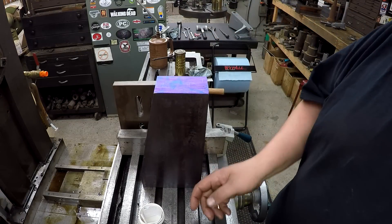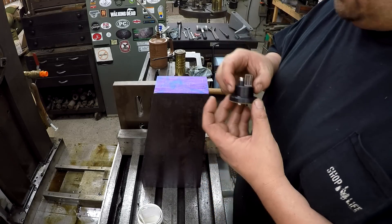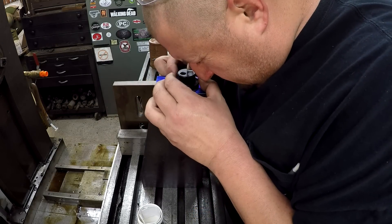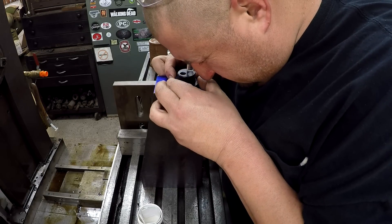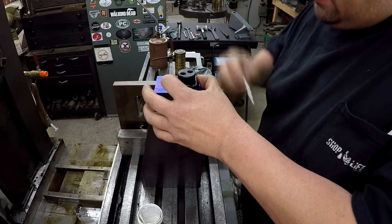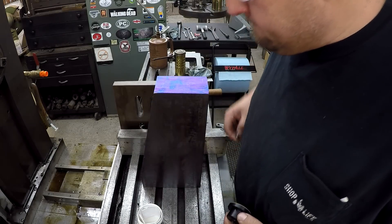While we're here, I'm gonna use this optical center finder that I just recently got from Tom Taylor, and just give it a really light punch to try it out. I'll pull the punch part of it out — that looks really nice. There's a black circle and then there's a black dot right in the middle. I'm gonna line that thing right up on the cross here, hold down on it, pull the optical side out, drop that down in there, and just use a little ball peen to get a little tap there.